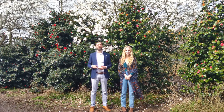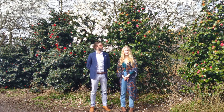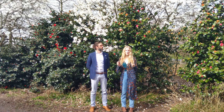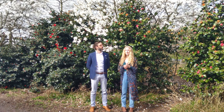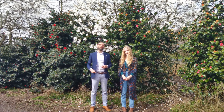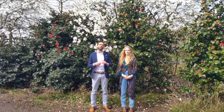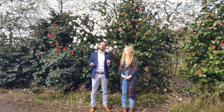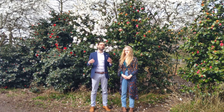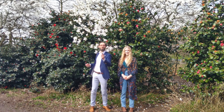So we built the Kick It together, taking turns at the soldering iron. It was great — incredibly fun. Through-hole projects feel a little bit more chill and relaxing, like a meditative process. However, the resistors were incredibly close to each other, so that made using a soldering iron and trying not to burn components a little bit tricky, but overall it was manageable. The advice I would give you if you're going to build your Kick It is to pay really close attention to the order of operations in our build video. For example, it's really hard to place the caps on the back of the PCB after you've first soldered the resistors, so that's why we placed those caps first. Hopefully the build video will be instructive and will help you get through the process easily and effortlessly — and you'll be kicking it in no time. Let's take it to the build.